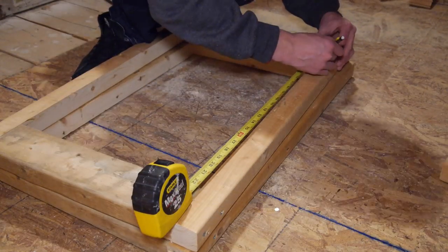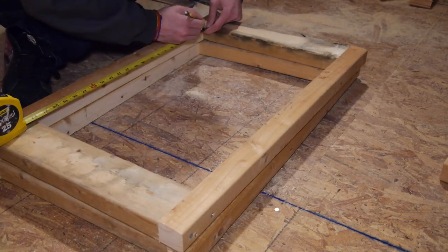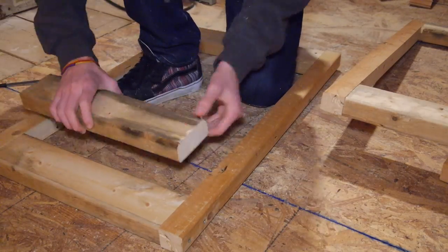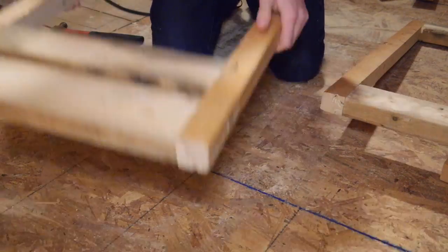After that I measured up 18 and 3/8 inches and 7 inches from the top of the bottom 2x4 to figure out where to put my record shelf supports. I messed up here because my amp isn't sitting on the 4 inch side of the 2x4, but instead the 2 inch side of the flat 2x4 that will connect the bottom of the cabinet.